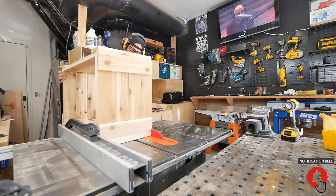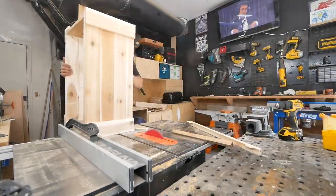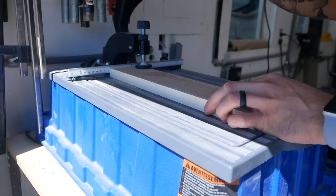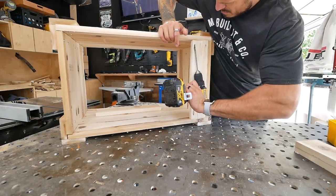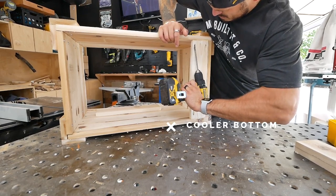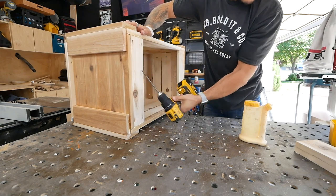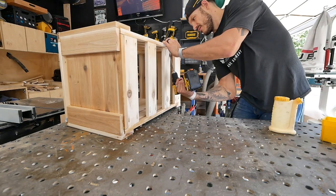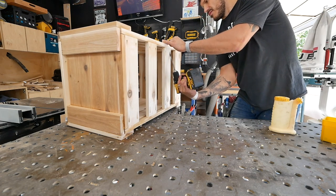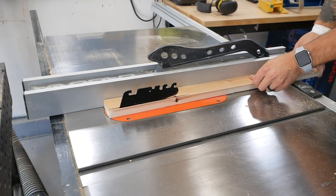Based off my cooler dimensions, the last and final panel was an inch and a half too long, so I brought the entire project to my table saw and trimmed it right off. For the bottom part of this cooler stand, I needed something that would not allow water to pool up at the bottom in case something was spilled or leaked. So I decided to use four cleats - basically four of the 1x4 pieces - put some pocket holes in them and secured all four for structural support with wood glue and pocket screws. This way it'll hold the cooler and if something ever does spill, it'll just go right through.